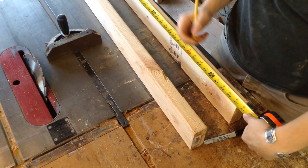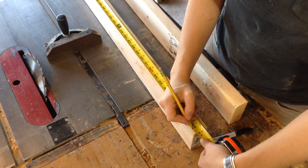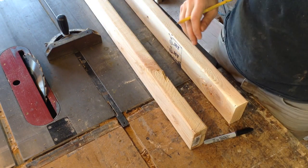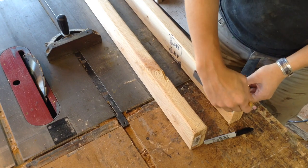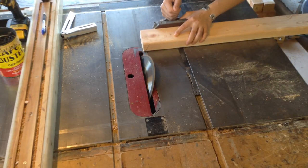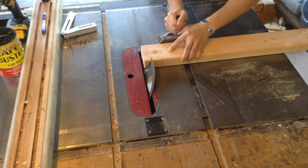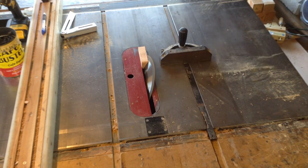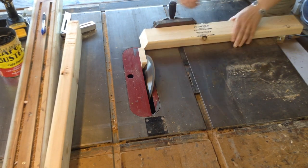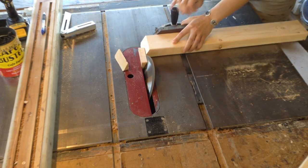It was a matter of lining everything up and getting those measurements. You could see I could transfer them to the ends using that bevel gauge to give me a guideline, then trim all the pieces down. I pretty much built this piece by piece, but once I had that 30-degree mark, everything was 30 degrees. I could just go through and trim those down. These are going to be my short ends, and then I fit them to that template.